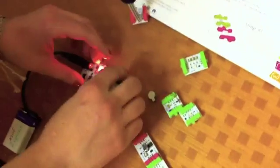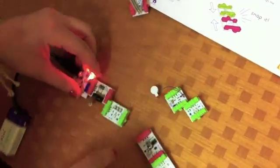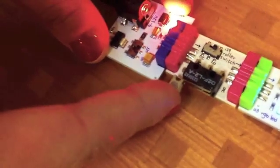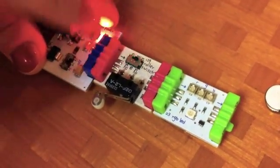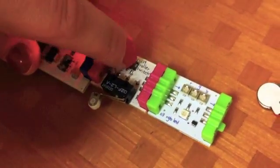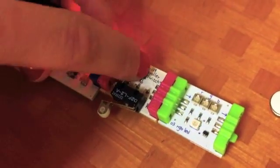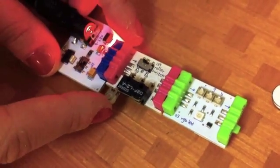Here, for example, we have another switch. It's a roller switch, and as you apply pressure to it, it turns on and off, and it has this knob that's a mode switch. It's normally on or normally off. You can see here, for example, it's normally off unless pressure is applied, and if I switch this knob, it's normally on unless pressure is applied.